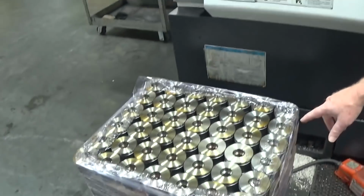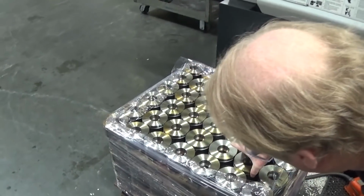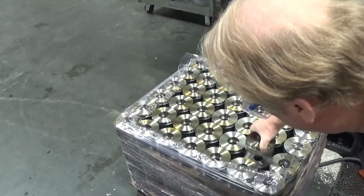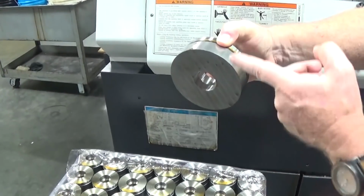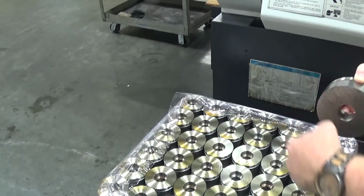This is a rotary table. This would be the top. They're going to take this material down to get the profile, and this will be taken over to that gear hob cutter I showed you. The gears are put on.